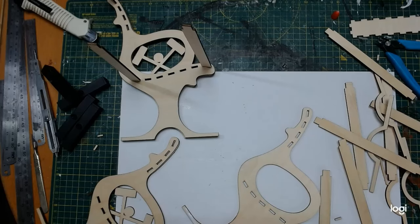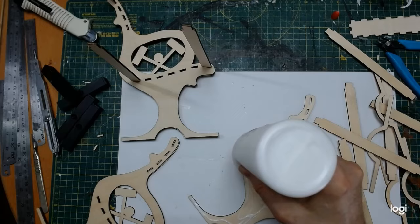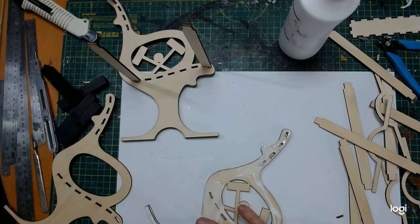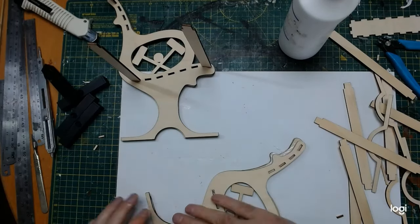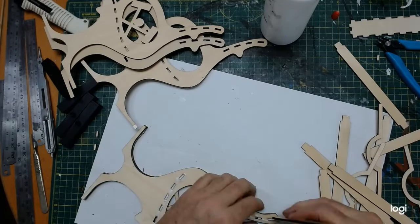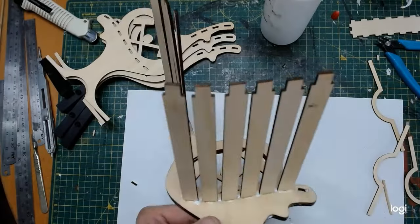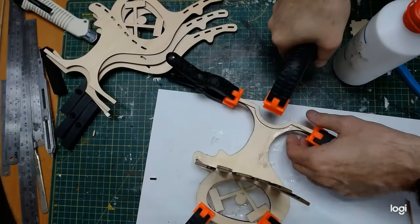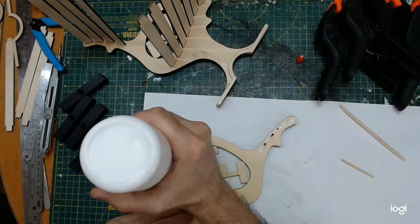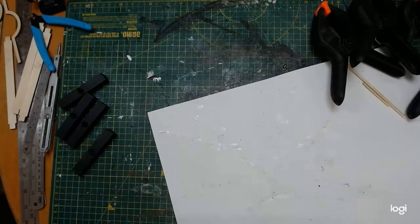While that all dries, I move on to the bench. And this is a far simpler affair, as it's purely made by laser cutting 3mm plywood. Same as the cart, a simple design in the 2D program of your choice. Cut out the pieces, glue them together, give it a bit of a paint job, job done. Now in the design of the sides, I've tripled up the plywood, as I've only got 3mm thick board. But this did allow me to incorporate a two mallets and a ball kind of logo in the arms. And then the slats are cut out to locate in little slots, which makes assembly really simple.